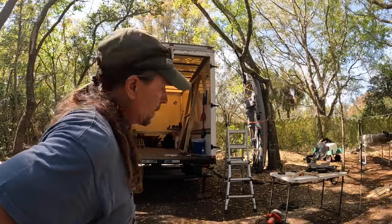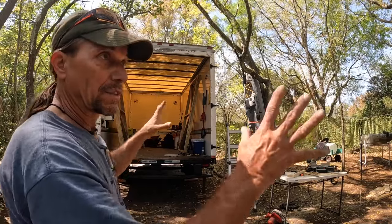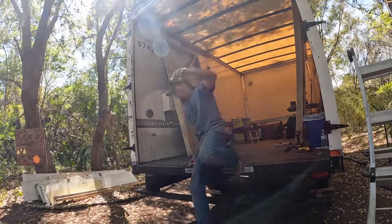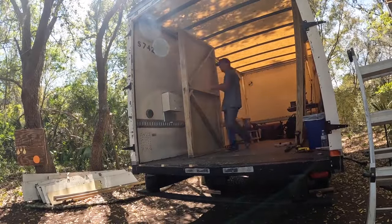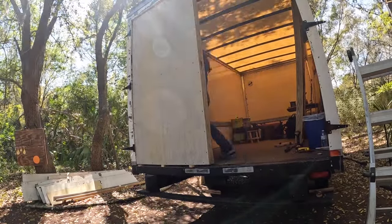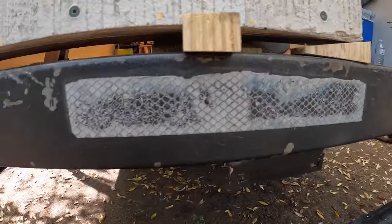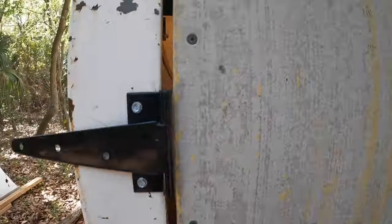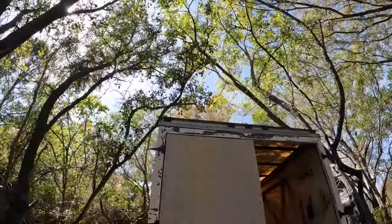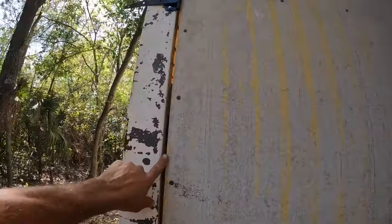Now all the hinges are in place on the frame side. I'm going to shim the left door in place where it's got to be, and then we'll screw the hinges to the door. I must say I was a little bit concerned about the door falling out of the opening here. So I was using a lot of caution here. Fortunately, my expert technique got it positioned just right without any incidents. And I got a nice space underneath. Nice even reveal the whole way going up, and along the top also about 1/2 inch, and that'll be perfect for some insulation later on to squish in there.